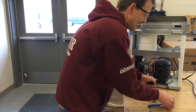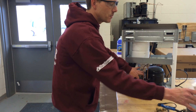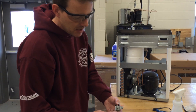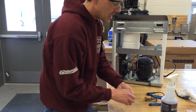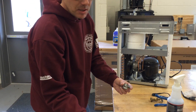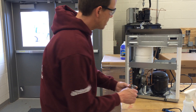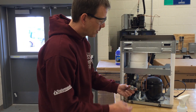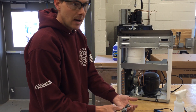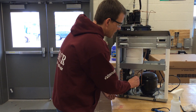The first thing we should do after installing any type of piercing valve onto the pipe is leak test it with some soap bubbles. Once you put one of these piercing valves in — here's a 3/16ths size, this one here is a 3/8ths size, this one here is also 3/8ths — and some of them even come with collars that can adjust for 5/16ths, and then this collar right here is for a 1/4-inch. So this is the one we're going to use. For this one, we're just going to use the 1/4-inch on the high side of the system.